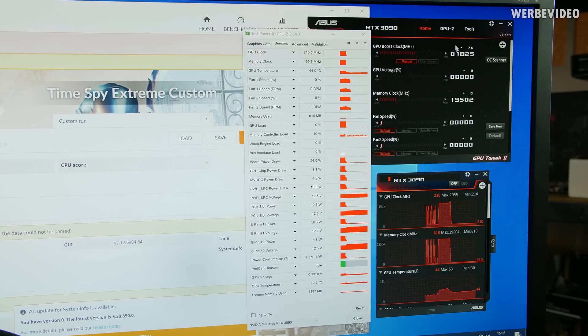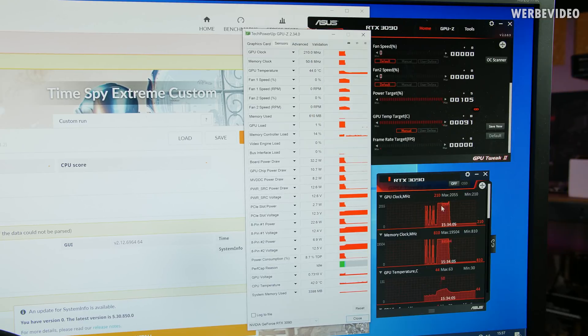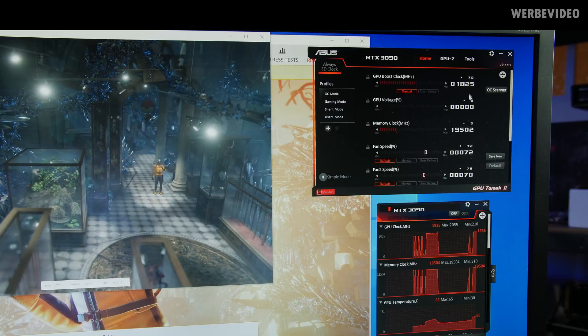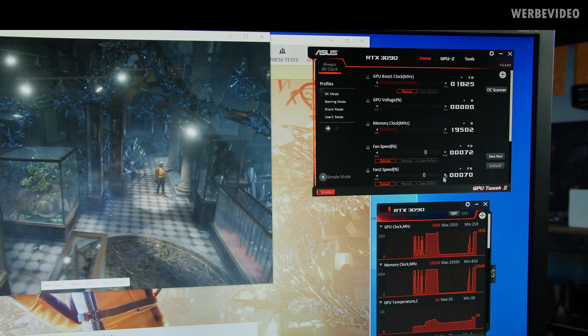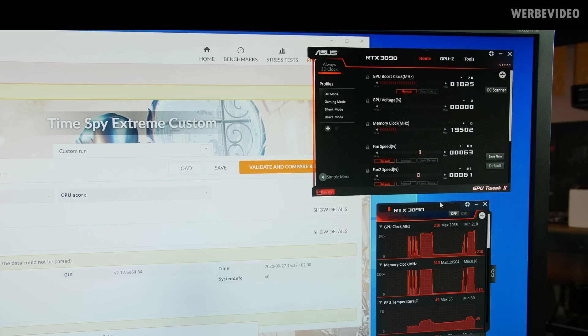The first quick test was more impressive than I thought. With the same clock settings, power target, and GPU temperature target as before, the test wouldn't even run one minute — it crashed directly after about one minute, while previously it would pass over one hour. To be safe, I repeated the test a second time with the same settings, and it crashed again in under 30 seconds. There's definitely a bigger influence from those capacitors than I thought.